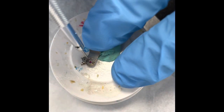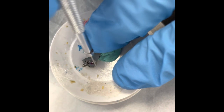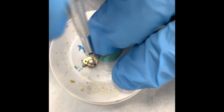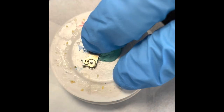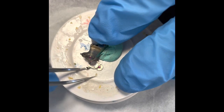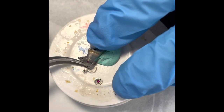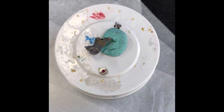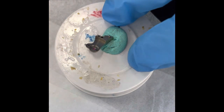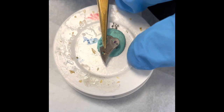This is the extra hassle, taking the entire balance out and taking these two screws that hold the plate that has the capsule in place as well. Also, this plate holds the regulator in situ. So here we've got our upper capsule. We have our regulator. This can all go in the cleaning basket, together with these two screws. There we go.